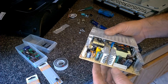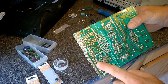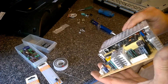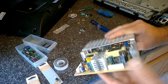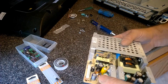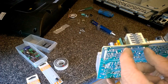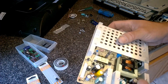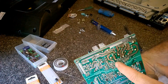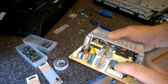These two right here look probably good — they're 820 microfarad, and they were fine on the other boards too. They're actually paralleled also, so electrically it's 820 plus 820, that's 1640 microfarads. If these were gone, a 1500 microfarad at the right voltage — which is 25 on this — put in one spot would work. Sometimes there's a reason they have capacitors at two different spots in the same electrical circuit: one would be for space requirements, or also to get them as close as possible to where it's switching, because in high-speed switching power supplies you get interference and noise, and you want capacitors as close as possible to suppress that.